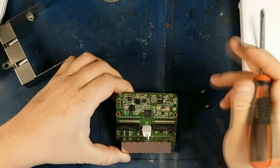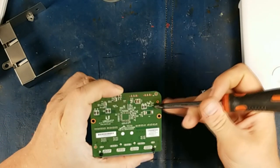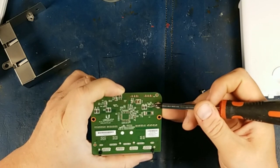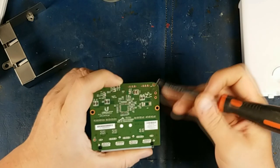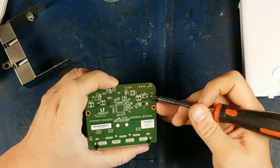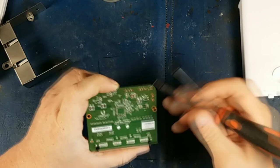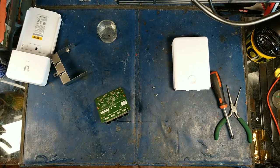Right here there's a spot that says CON 2. I'm curious about that, because if you look, there's a spot for a cap and a spot for a full bridge rectifier — as my hero Medhi Sadaghdar of ElectroBOOM would say, full bridge rectifier. Seeing that it's got a spot for a full bridge rectifier and two fuses on here, this would tell me that it'll accept 24 volts input right off of that.